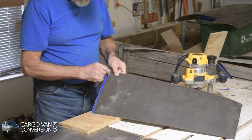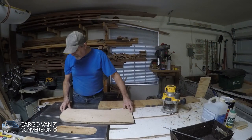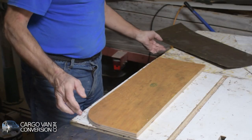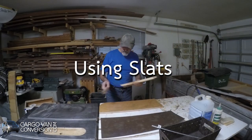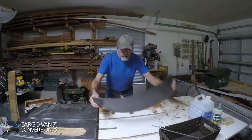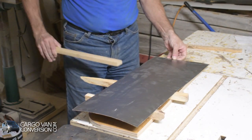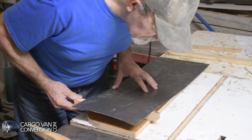They have the same cut as on the table saw. So that overlaps a little bit, and they can make another glue up. Both pieces have dried long enough so I can put them together. With larger pieces, this is not really large, but certainly if you have larger pieces, what I do is use a couple of stakes or so. So you can place it and then just release it from one side to the other.